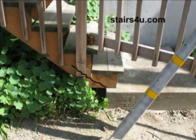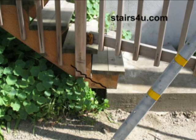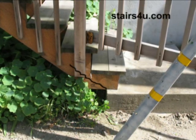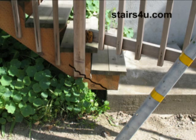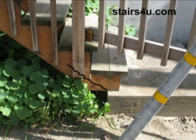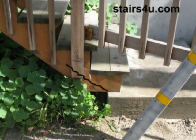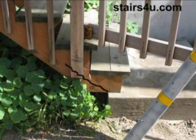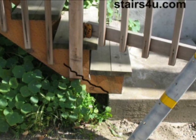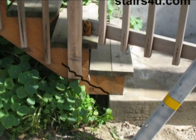You need to always have something underneath the bottom of the stair stringer — it needs to be supported — whether it's micro-lam, para-lam, or regular conventional construction lumber like this. Here's what happens: over time, the lumber starts to dry out. And when it starts to dry out, it could crack. And if it starts to crack, then you are going to have a problem eventually.